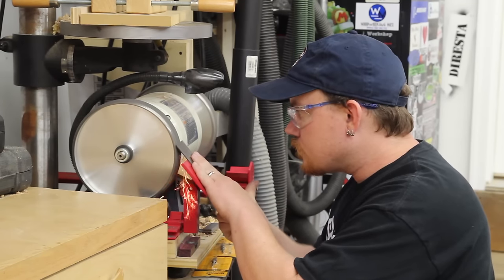Now I'll spin this around and install the rear handle next. This requires a long threaded rod and a brass nut or cap on one side to go all the way through here, and it will go into this screw hole here. There's a small one over on this side that I can get started on the front of the handle. The front handle is installed the same way — we've got another brass cap threaded inside, and we'll put a threaded rod inside it and put it through the handle.